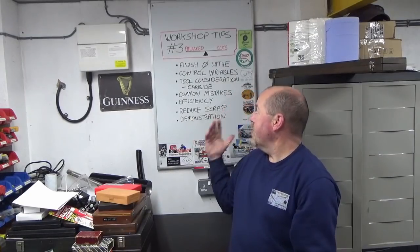So in this episode, we're going to talk about finish cuts on a lathe, finish turning fine limit diameters. It's all about controlling variables, and that will make more sense as we get further into it. We're going to think a little bit about tooling, and take a closer look at carbide inserts. This is really important for finish turning on any material, but especially the harder the material. As you get into the stainlesses and the nickel alloys, this becomes more of an issue. We're also going to talk about the common mistakes, and we've just covered a few there, but we'll try to show some of those in a bit more detail.